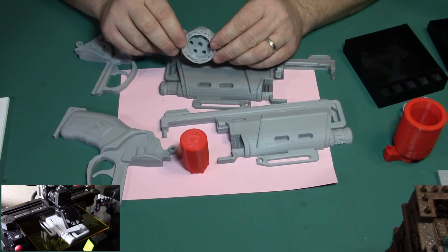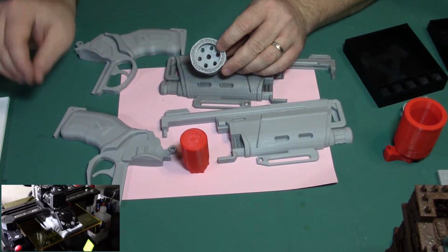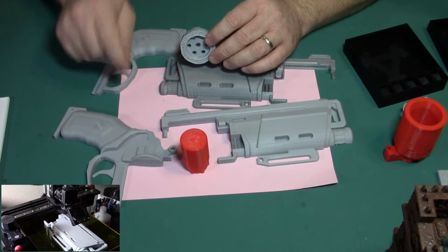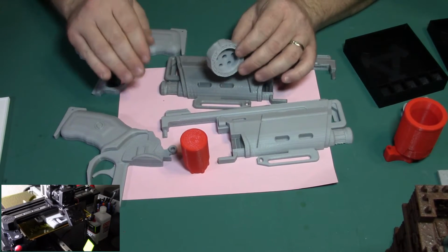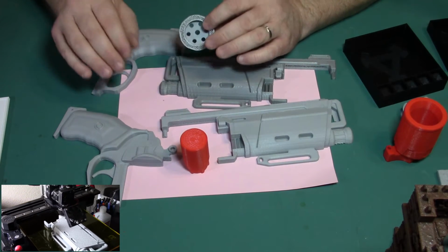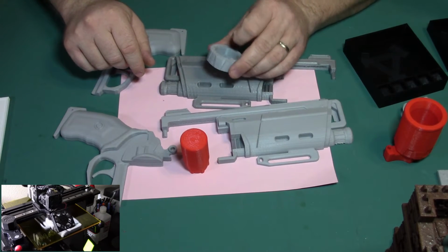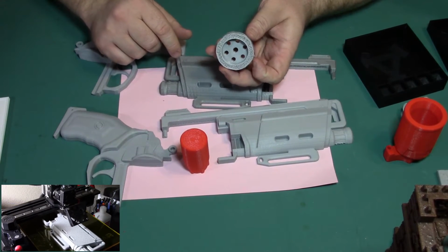And I think what exacerbated that problem, why it jammed, is I printed all those Guild Ball templates and I switched out 5 or 6 colors of filament, one right after the other. And every color of filament has a different property, even though it's the same manufacturer. So I think me doing that and not running any cleaning filament through the printer helped with that jam that happened. So this printed up to about this far and then it stopped extruding.